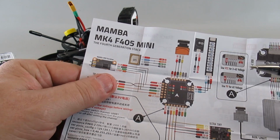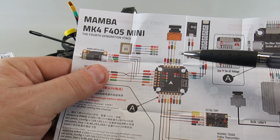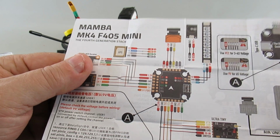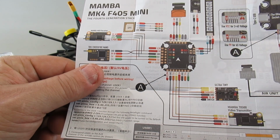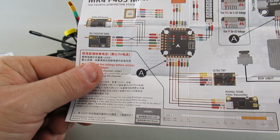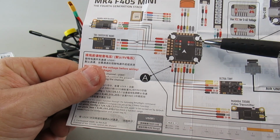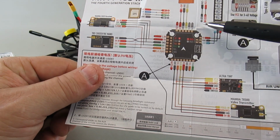One was that I had a wire going from the controller to the VTX crossing over the top of the ESC board, which was picking up a lot of interference, so the signal to the VTX was distorted. And then as I was flying, it was losing sync, so I had to disarm and land. In diagnosing that, it turned out I had to connect all the grounds from the camera, the VTX, and the flight controller to the same ground point, instead of having them spread around the board like usually shows up on these diagrams.